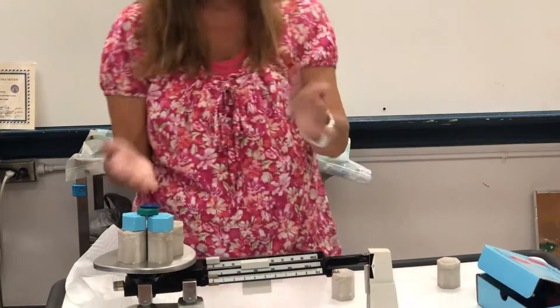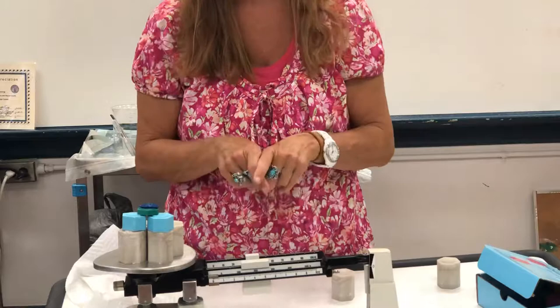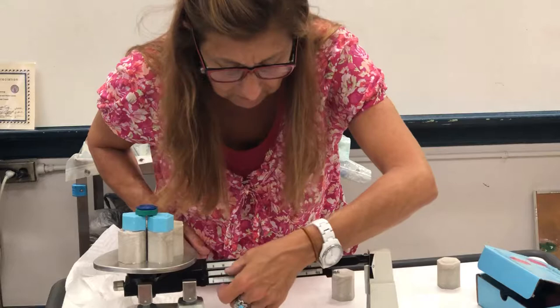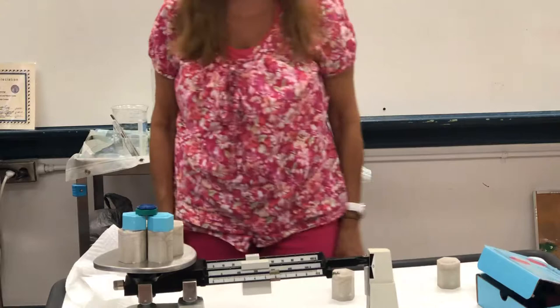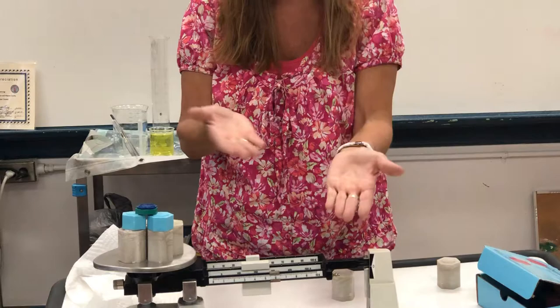We can still see that there's not enough mass on this side. Now I'm going to go ahead and move this up to the 40, so I now have 240 grams of mass on my beams, but I'm still not balanced. Then I need six more grams, so I'm going to come across on the bottom beam until I find the six. And when I find that six, just like that, you're going to see that the balance has indeed moved to the neutral position, where I have equal masses on the beams and on the pan — which is what this part of the balance is called.